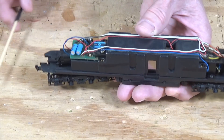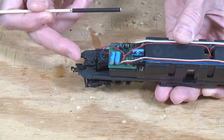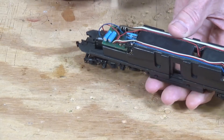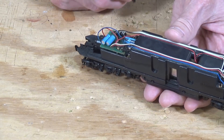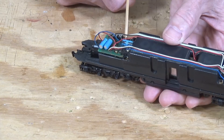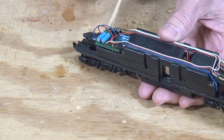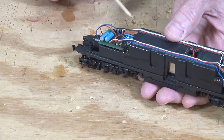We've got several inches of space back here because the end of the locomotive shell goes all the way to the back. Unfortunately, it is not enough space to use one of the standard Atlas-Athearn-type circuit boards used as replacements in a lot of locomotives — you need something a bit shorter. Fortunately, the Decoder Buddies made by Nick's Trains fit in here quite comfortably. I'll probably end up using a mini or the standard one. I'll put a link to my previous video on those above.